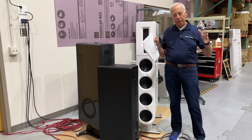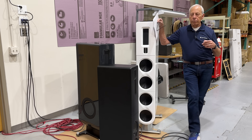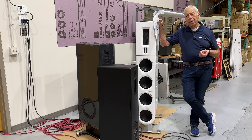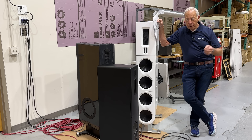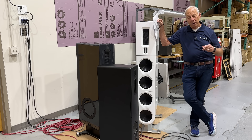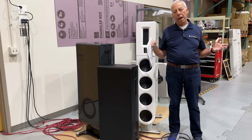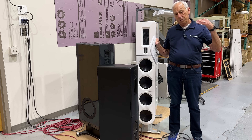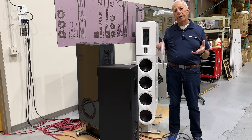You need something that is probably a good 5X margin if you can. Most systems rarely take more than 10% of the power that an amplifier has to provide, until there are some big bass notes, in which case you need to have some power in reserve. So best case, if you have a 100-watt amplifier, you probably want a 500-watt or a 1,000-watt step-down transformer. Use a 5X to 10X ratio to whatever it is you're trying to power.